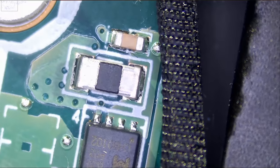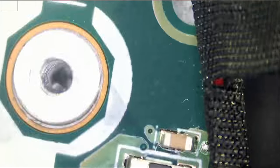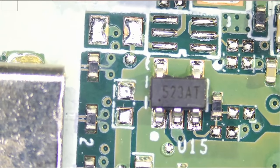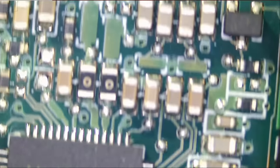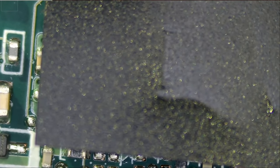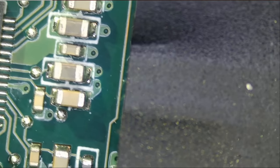I'm just looking for possibly blown or discolored components — anything unusual on the board. Because a lot of times when there's something wrong, it's obvious. Other times the fault is not obvious, which is more difficult because we have to do a lot of measurements. We do not have any circuit diagrams for this laptop, so everything must be done based on experience, physical inspection, and the thermal camera. So far the board looks mint — I do not see anything obvious.